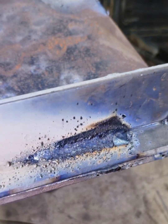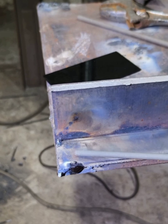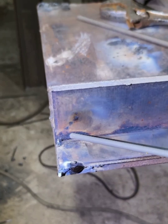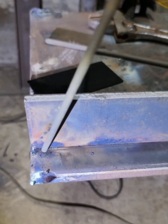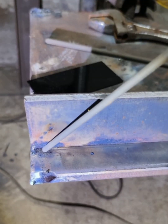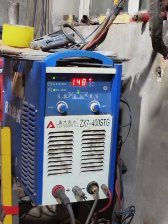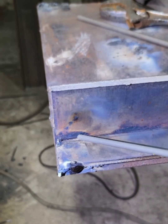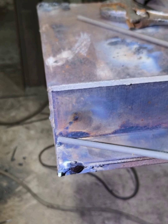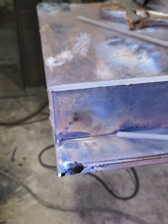For the correct method when welding flat fillet welds: the angle between the welding electrode and the lower plate should be below 45 degrees. The plate lying flat is called the lower board; the one standing up is called the upper board. The best angle between the lower plate and the electrode is below 40 degrees. The angle between the welding electrode and the welding direction should be about 75 degrees. The current should be about 15% larger than for flat position welding. Fillet welding is three-way heat conduction and can withstand greater current, but not infinitely. The starting position is very important: ignite the arc 3 centimeters before the welding end from the upper side, slightly pull the arc to the return strip on the upper side and bring it down to see the formation, then pull the electrode tip at the root in a straight line without swinging.